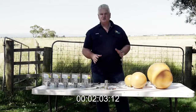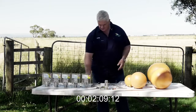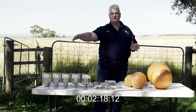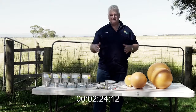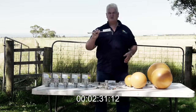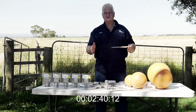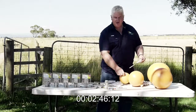We do a series of different configurations depending on your trough. If you've got a round trough, we recommend a 600mm or 400mm arm. The reason we like a 600mm arm is because it gets the float right out in the middle of the trough so the stock don't play with the float and don't have any impact on your valve. If you can't fit the long arm because you're running a coffin trough, have a cover, or a restricted area, you can use a smaller 300mm arm. On plastic troughs, we've got an arm with a 100mm thread that you can cut back to whatever you need to fit into those small cavities, and you can put either a 6 or 8 inch float — though in most instances you can only fit a 6 inch float.